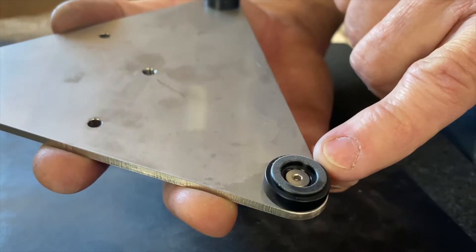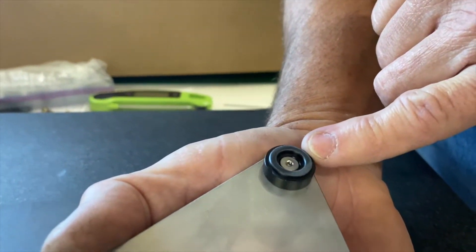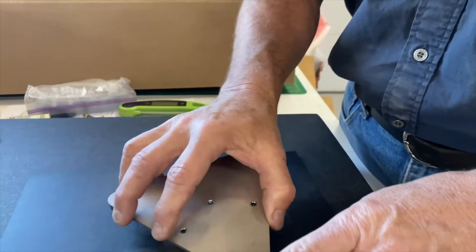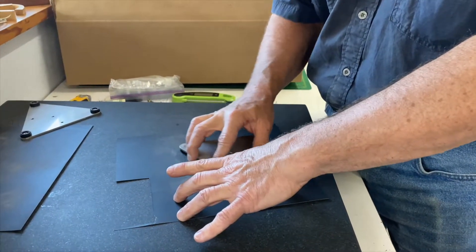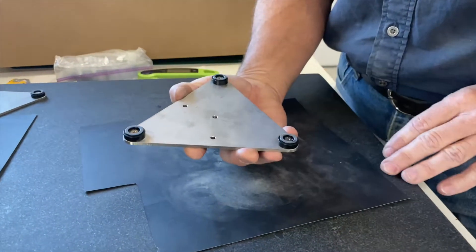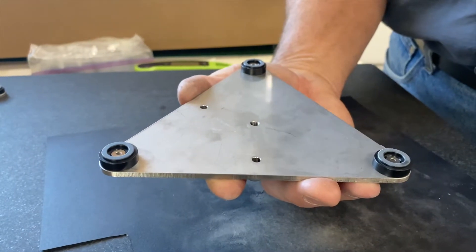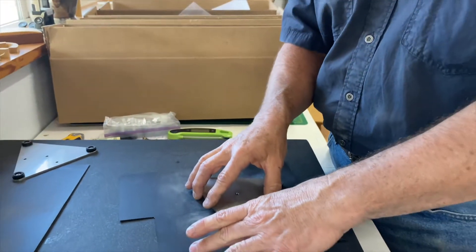You can see it on all three of those contact spots. We're not taking off a lot — maybe a couple thousandths or so — just enough to make this triangle support act as a single unit rather than three separate regions.